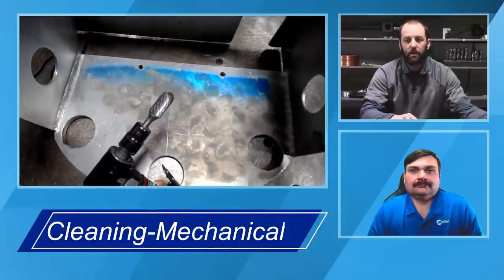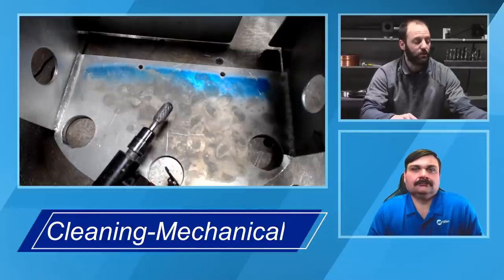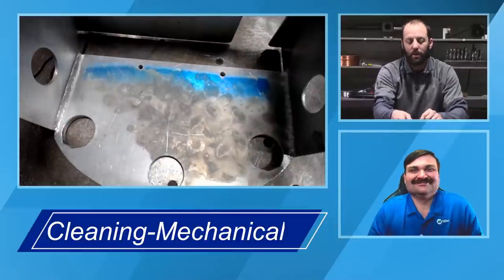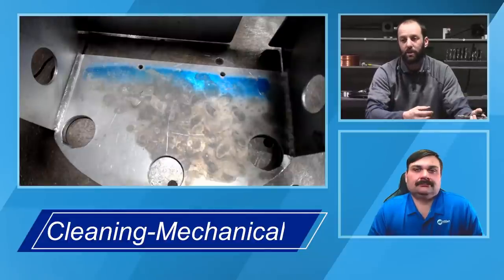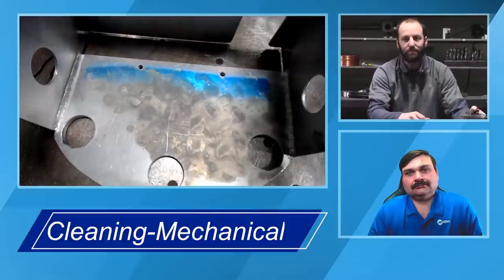So having a rear exhaust, even though the front exhaust may be blowing chips away for you, is going to be a better solution, simply because most air tools, if you actually look at the manufacturer's recommendations, are going to say oil daily. Or if your system has an automatic oiler on it, it's going to be putting oil into that stream of air coming out. Also, as that compressed air comes out of the tool, it could be bringing condensation from the line. The recommendation is that you drain your air compressor tank on a regular basis. If you've ever done that, you know there's a lot of water condensation that collects in there. That's really coming from the temperature and pressure differences within the air compressor, and that can get sprayed or deposited onto the surface of the material.